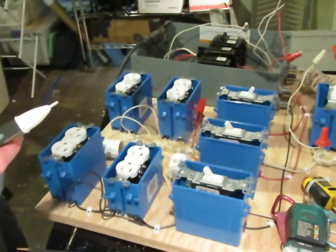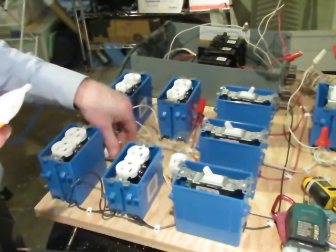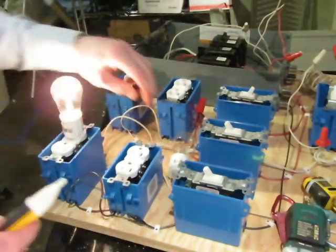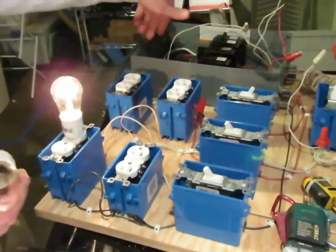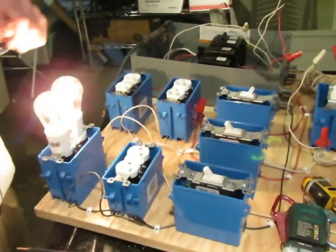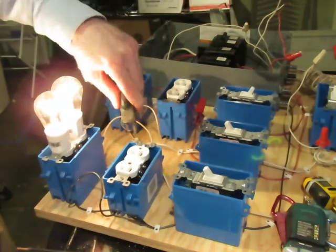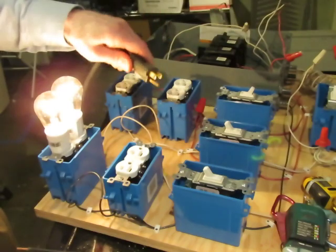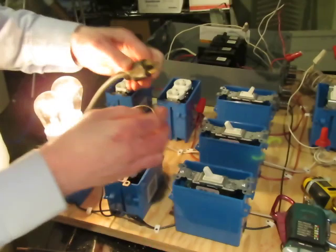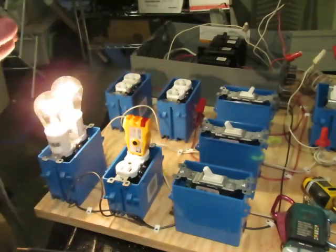So we're going to demonstrate that and see how it works. I'm going to put a couple of bulbs in here so you can see the breaker trip when I do the test — that'll make it easier to see. This is just an appliance; it has a three-prong plug. First of all, I want to show how this will indicate that it is in fact wired properly per the tester, though of course the tester can't detect a bootleg ground.